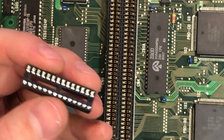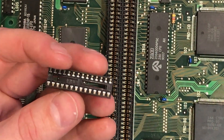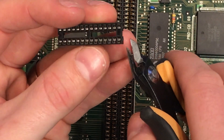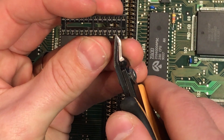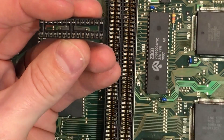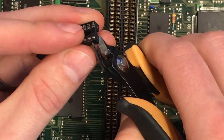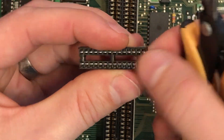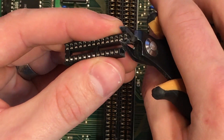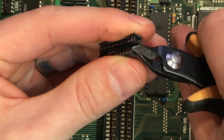The sockets are actually too long - we're two pins too long. All you do in that situation is try and keep the notch intact - it's just a nice indicator - and snip off two pins. When you snip them, you don't want to cut into the third pin - you want to leave that plastic in place. Cut right through the second pin and that'll just get destroyed and cut right off. Otherwise the pin you want will fall out and you don't want that. Cut it there, it'll snap right off, and as you can see we're left with a jagged edge but the plastic wall is still intact, which is exactly what you need.